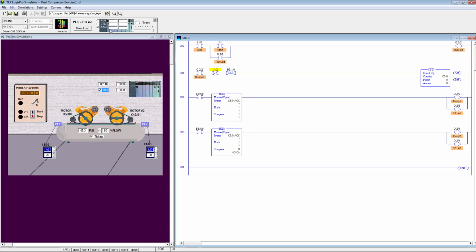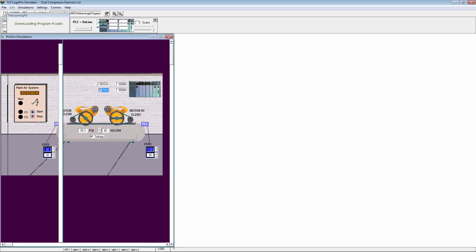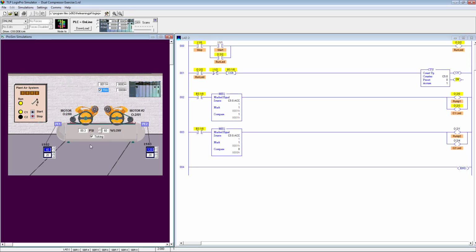So let's try. Switch it to the programming mode and reset your simulation, reset counters, reset all data, then program, click on run, start. Let's decrease the floor offset so that it can go to the maximum point quickly, and you can adjust according to the constraint of the exercise. In the exercise we are asked to keep it at 120 and the span is 20, but I need to show it quickly, so I don't want to wait up to 120, that's why I put it on 40.